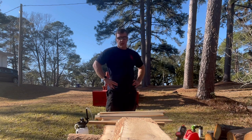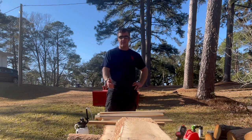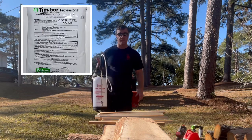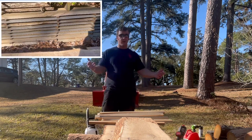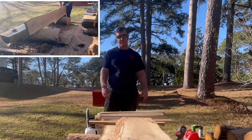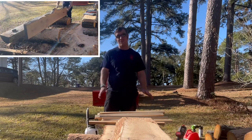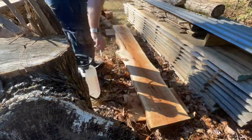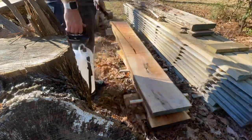Making your own lumber at home has a lot of steps. You do save money, but you have to be diligent — otherwise half the lumber ends up as waste anyway. The first thing you have to do is paint the ends of the boards so they dry evenly. I've got a sprayer loaded with timber treatment to spray everything down and keep the bugs from eating it. You have to stack and sticker it so it gets adequate airflow to dry, and I'm even removing the bark because I noticed some termites — I want it to dry faster and get rid of those before they chew up any usable wood. It's still worth it, but the very last step is to spray everything down and sticker it and wait — honestly about three years for any of this to be ready.